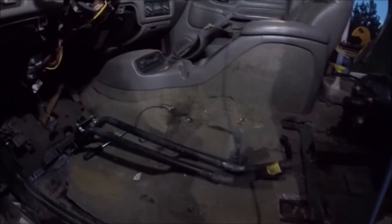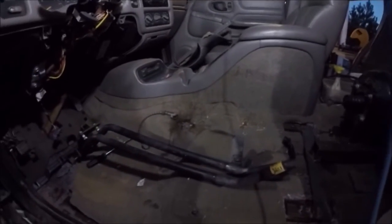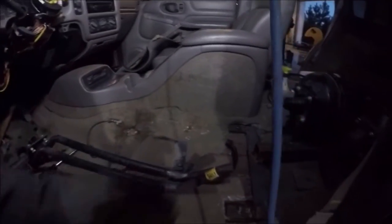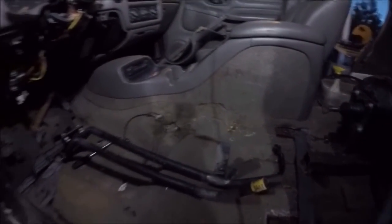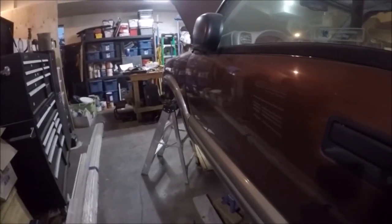So next video, I think this is enough for one video, I'll get that mounted to the floor, get the clamps made, get the rods built, and then the rods have to go right against the carpet because there's not much clearance underneath the seat, and build a guide for the one rod. I think the other one can just go down and then bend up a little bit. With the amount of force, I don't think it'll bend the rods, 3/8 rod, so it should be okay.